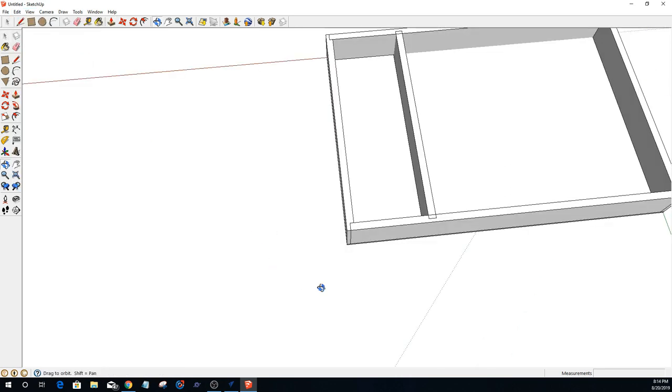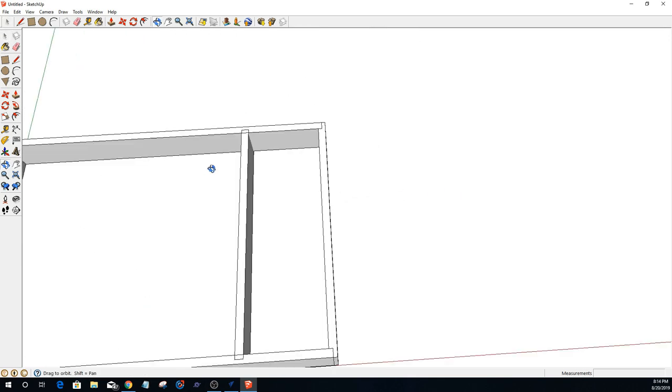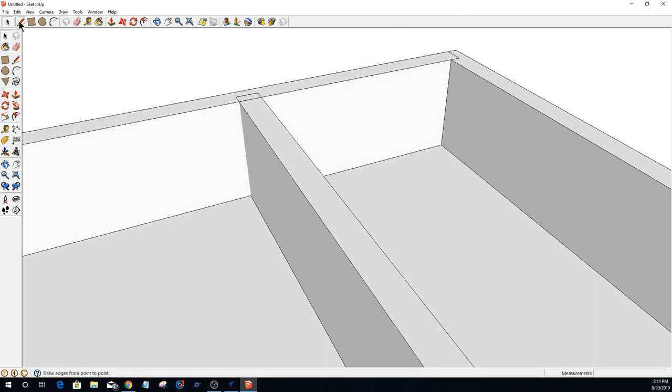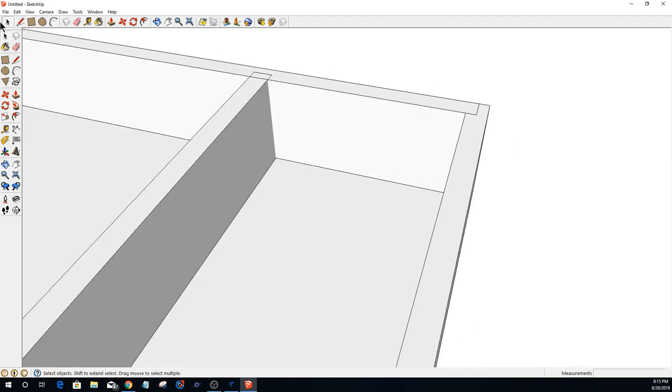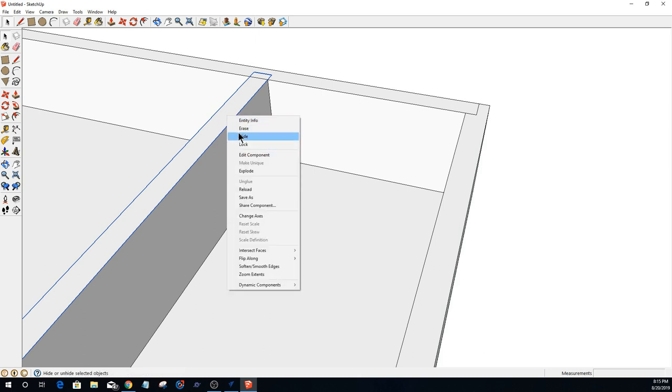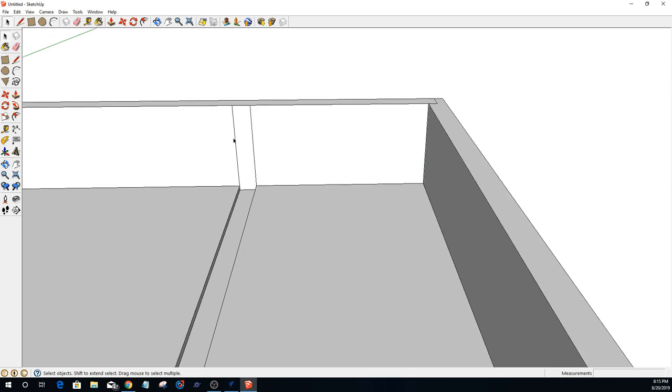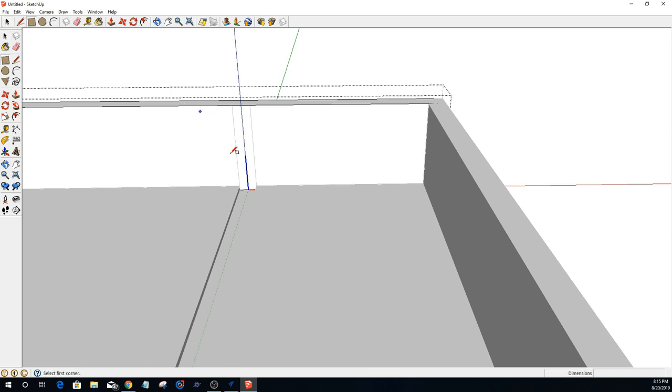Oh. All right. So this is going to be my basic cabinet and everything here. And so what I want to do is draw a line right down here. Space bar to finish that line off. I want to draw a line right down here. Space bar to finish that off. Wonderful. The reason why I'm doing that is because I'm going to hide this piece right here. That's just going to give me an outline. Of course, I had the outline down here as well. That's going to give me an outline to create my little rabbet so I can push that back